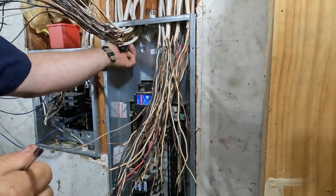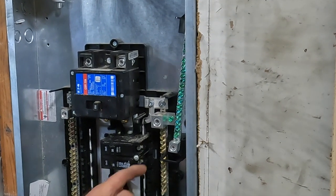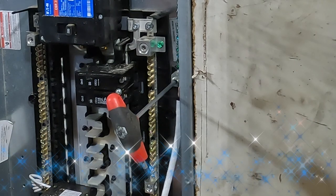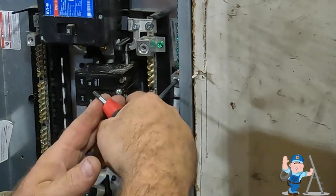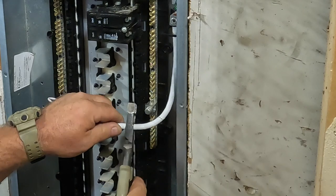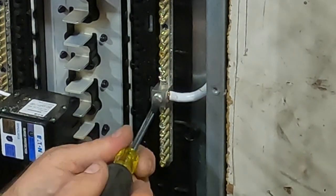As you can see, there's a big mess of wires here. There I am changing out the bonding bushing, making sure it's nice and tight and secure — there are set screws on the bonding bushing as well, which mechanically fastens it to the nipple. Some of my conductors are short, so I'm adding a neutral bar — not a ground bar. The neutral bar is isolated from the enclosure because NEC section 200.2 prohibits using the enclosure as a current carrying conductor, and a neutral is a current carrying conductor. I'm using the big lug at the top to attach it to our ground bus on the panel, using number 4 copper for this jumper as well, which gives me more terminals to terminate my short equipment grounding conductors and neutral conductors.